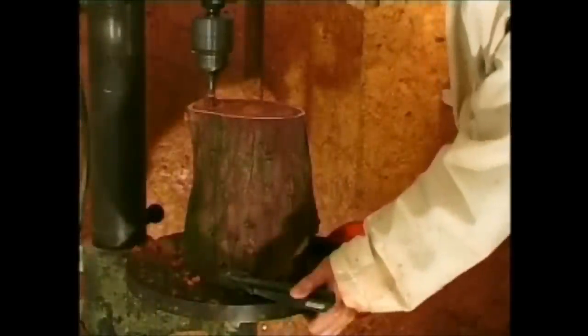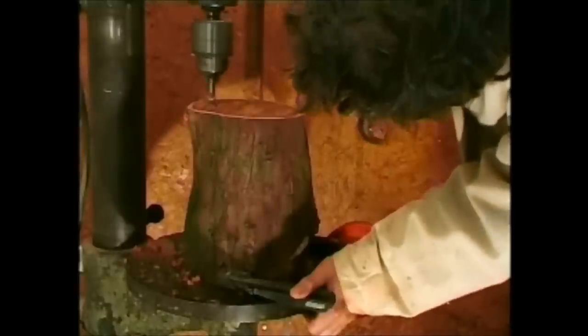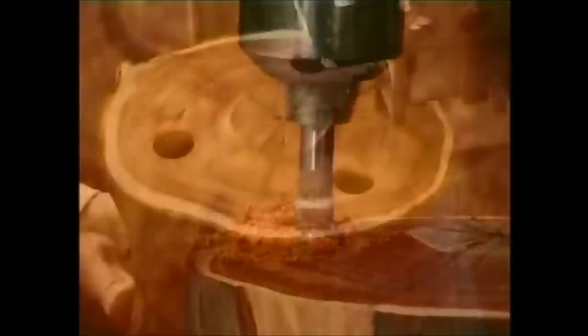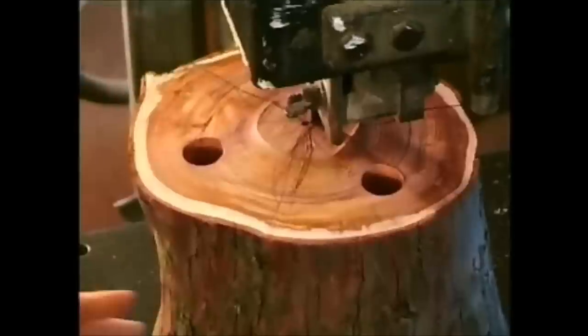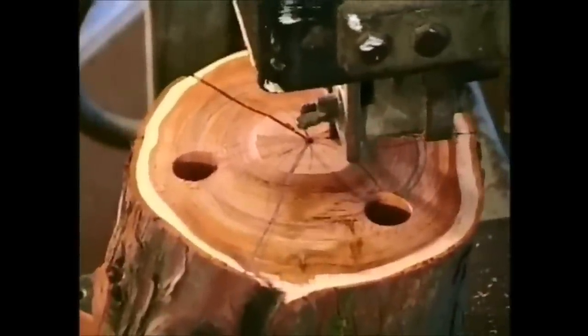I'm using a 7/8ths 22mm drill to fit the brass candle hole liners. Hold the log securely — here, a clamp holding the log is also clamped to the drill table. Drill each of the candle holes before separating the three sections. Cut along a line into the centre of the log. Stop the saw before removing the log from the blade. If you try to remove the log while the saw is running, the blade may well come off the wheels. Sometimes the log will pinch up and refuse to come free. If wedging the crack open will not remove it, you may have to cut right on through and start again.